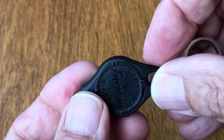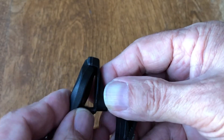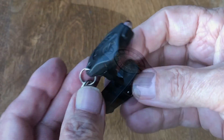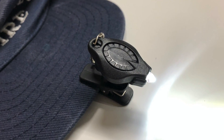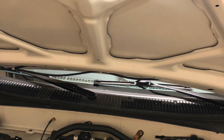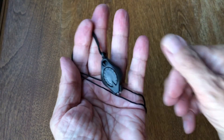The Photon Freedom is a 7-gram minimalist light using a high-quality 5 mm LED giving 4.5 lumens of neutral white light. It uses two CR2016 lithium button cells in series, giving over 12 hours of unregulated light, meaning the light will diminish in intensity over time, though the angle of projected light continues to provide a good hotspot.